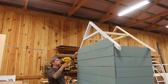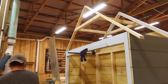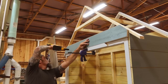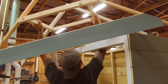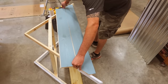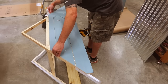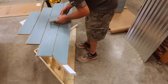The easiest way to find the perfect angle is just to mark this starter board on the back, make those cuts, and then fasten it to the trusses — this will ensure that everything will be perfect. On the front I've put an inch and a half spacer on my header because all of my trim will be an inch and a half. Make sure to fasten only to the truss itself and not to the actual building — we're going to be taking this off so we can finish going up with our shiplap without having to work overhead. I'm also using those same eighth inch washers for my spacing.